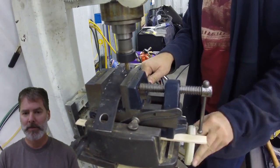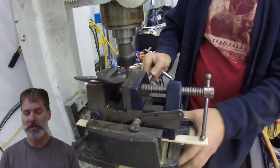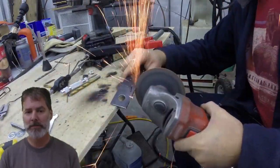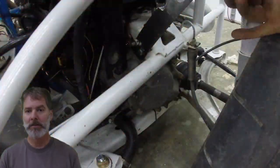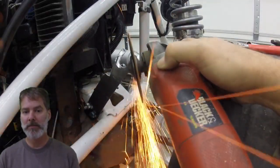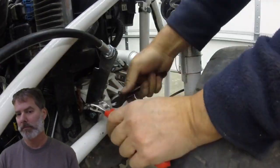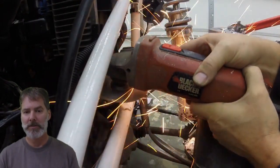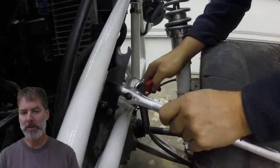For the rear transmission connection, I wanted to tuck it in closer to the fuse box. I used the milling machine to slot the holes a bit and give me some wiggle room to move it in closer. There's a relief cut in because it was actually hitting the fuse box — that gives me a little more room. I'm opening up the top and making a slot so it's easy to drop the cable in from above, then reducing the height of the forks on the slot. When I bend it forward I'm hitting the plastic again, so we're going to trim it back a little further to get it in the right position. Now I'm able to lean it a little more forward than before.